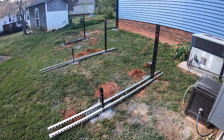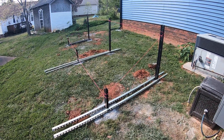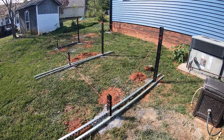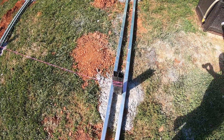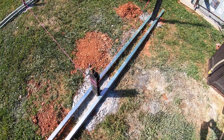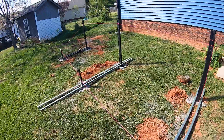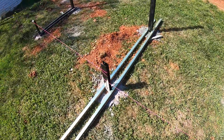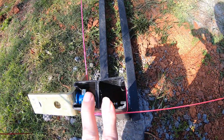Welcome back. What you can see here is the start of the solar panel mount system we were talking about earlier, in which we're going to have 19 100-watt panels. We've elected to go with unistrut — as some other individuals have done — and you can see that we've got the unistrut in the ground two feet, cemented in place, doubled up for strength. We've got our fronts in and our rears, and the way we did this was these two pieces are bolted together, as you can see down in there.